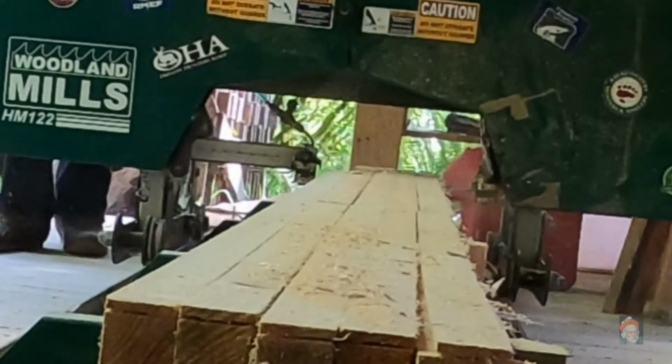I think what I'm going to do is take those out there and line them up where they go. See how many more I need of what. What I need is 6 out of the short board, none out of these. I'm going to come down, take off about 1/4 of an inch, and then I will have 4 2x4s, nominal.